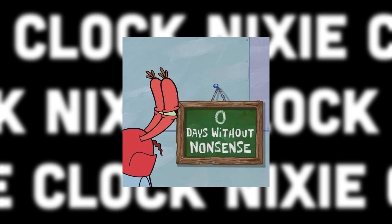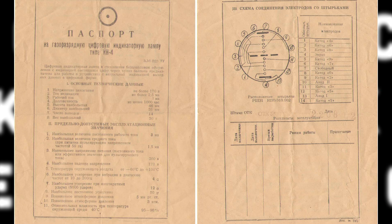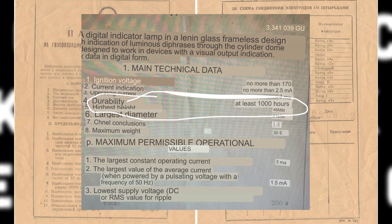It was two tubes that ultimately broke. And then the two replacements broke. It wasn't until a final set of six tubes and many weeks later that I was able to replace the broken ones and have four spares. I've since learned that the IN-4 tubes I used are the most affordable on eBay because they are the least quality and most prone to breaking. They also have the smallest number of running hours on their datasheet — a thousand hours to be exact. But there are ways to extend this life: decreasing the running current by half and programming a sleep mode can bring up the life of the tube by as much as 20 times. I implemented those changes, so I have faith that this clock will run for a long time reliably.